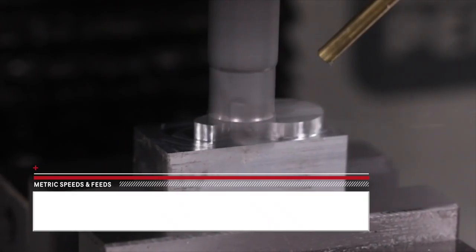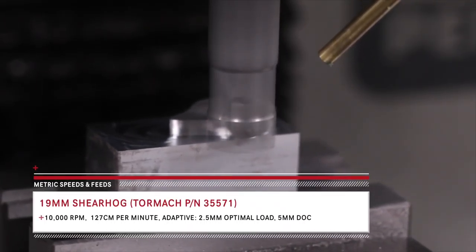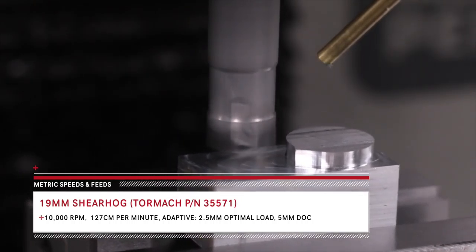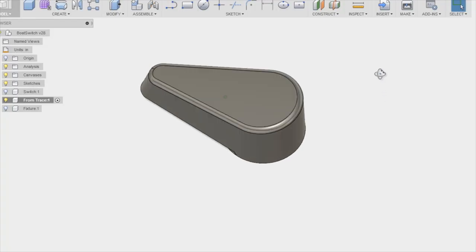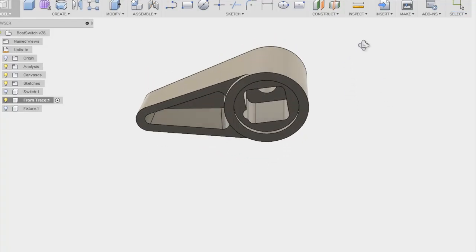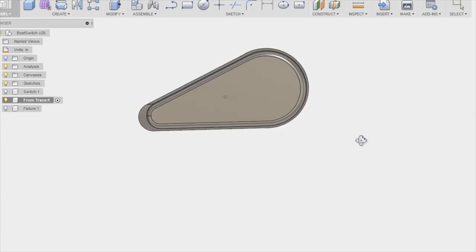The CAD we're gonna cover in this Friday's Fusion Friday, and I was pretty happy with it. This was a new thing for me because this part has a complex shape, which we ended up using the loft command to do because you can't just extrude it given the nature of that shape. So again, it took some playing.